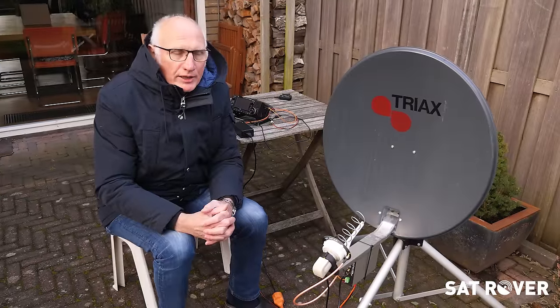I also show you how to find a satellite in an easy way, because some people have difficulties with that, but do it the way I do. It's very easy and you can find it for sure. And I show you how you can check your own signal from the downlink to see if it's all correct and that you're not overdriving the satellite. Yeah, let's go outside. Now we are outside.